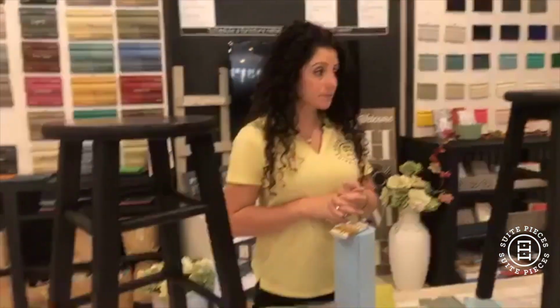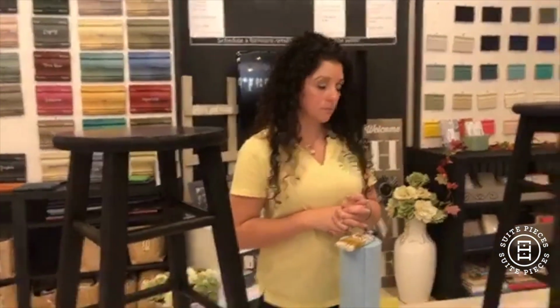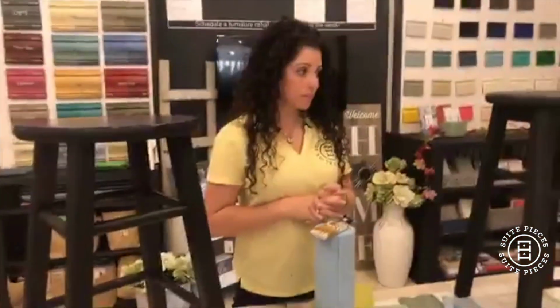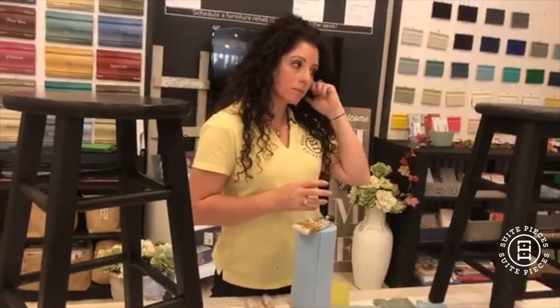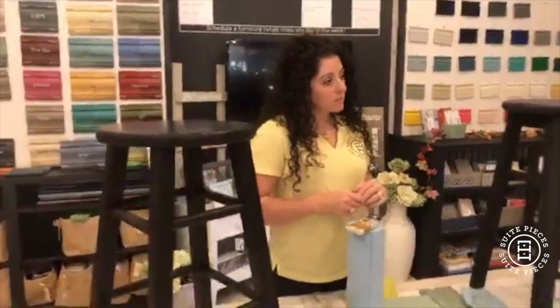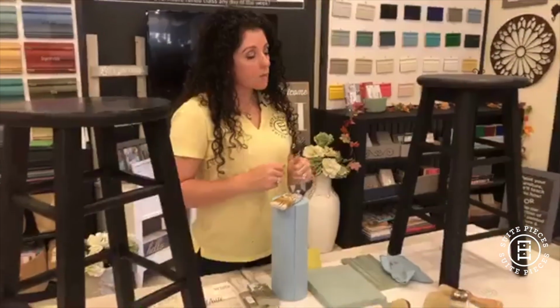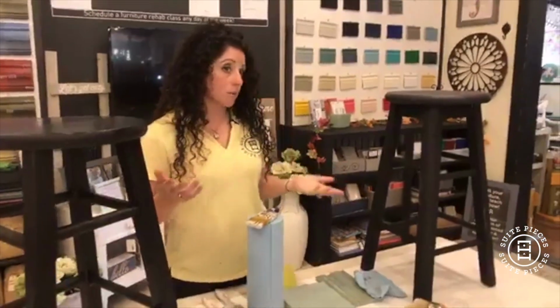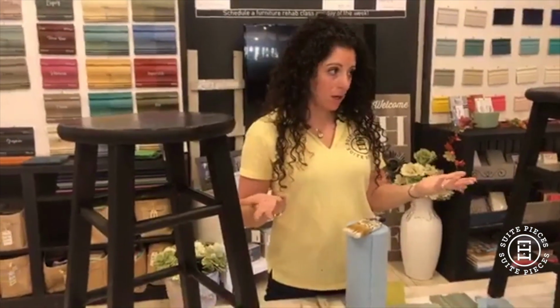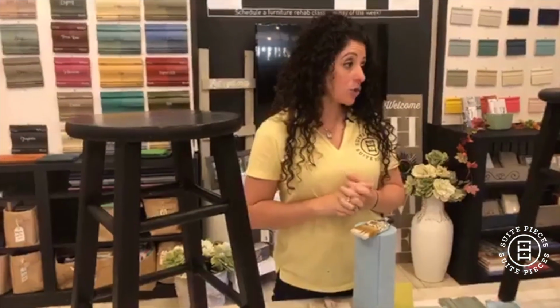And on kitchen cabinets, we have, I guess it's gloss white. It was told that it was lacquered. Okay. There's supposedly imperfections in the grain of the wood and stuff like that. You mentioned that you can use the matte finish. Yeah. So basically matte finish paint can go over pretty much anything. You do want to clean it and then just wipe it back, and you can pretty much paint anything. So you shouldn't have an issue with that.